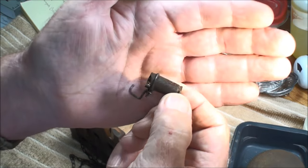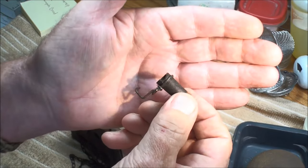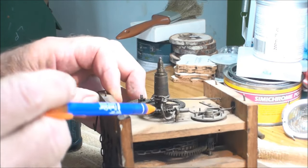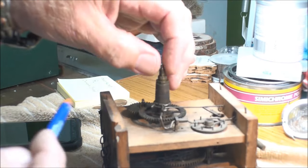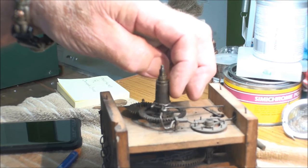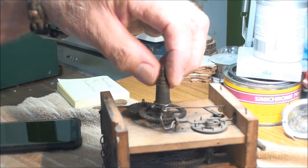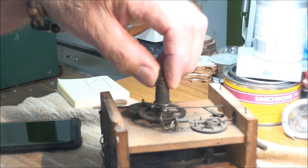And there you can see possibly the taper a little bit better with the alarm operates by. So before I take that off, to give you the idea of what's going on here, this here rod holds this from ringing at all, and turning this, which this here is the one that has the big hand on it that you select the hour or whatever, you can watch this going up and down, which makes this rod go up and down and releases to allow the bell to start ringing.